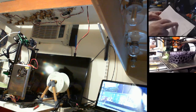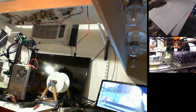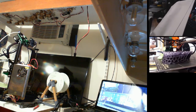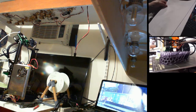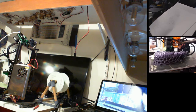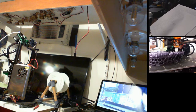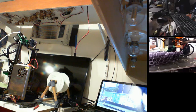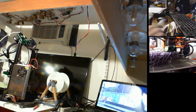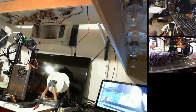So they pointed me at a Repetier firmware page about the EEPROM, and you can set all these parameters through just M205, 206 commands. So what I'm going to do is pull the original stock extruder off of the Zonestar, and we're going to put my modifications back on that extruder, and then we'll do a calibration test, and we'll see if it'll print something without under extrusion.